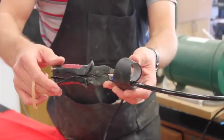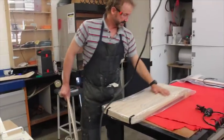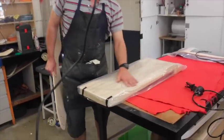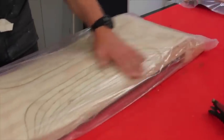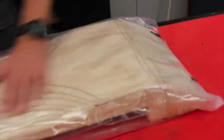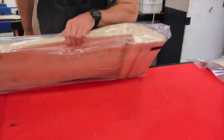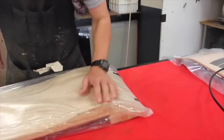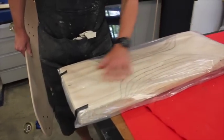It's really important for some of these boys to know that sometimes you need some help to do this. So this is the Cool Boy - this is the Cool Boy mold. This was the one that took me well over an hour and a half, maybe two hours to make, with some PVA, an electric plane, and a belt linisher. It's all ply and you've just molded it - fairly thick ply. This is just a protective bag, not an airtight bag - just so we don't get any glue onto the raw timber and destroy the mold.